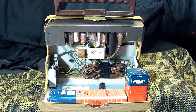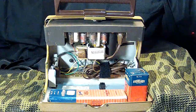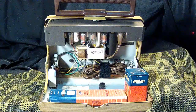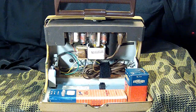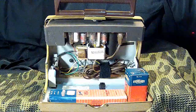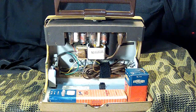This radio, like most portables of the time, was designed with a selenium rectifier. I'll need to replace it, as well as the electrolytic capacitors in the AC power supply section, before this radio can safely be used on AC current. Let's take a few moments to listen to the radio — stand by, I'll be right back.